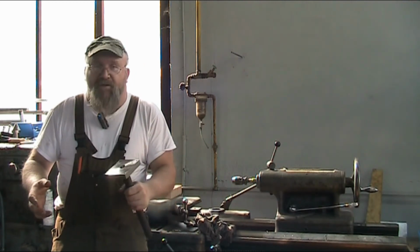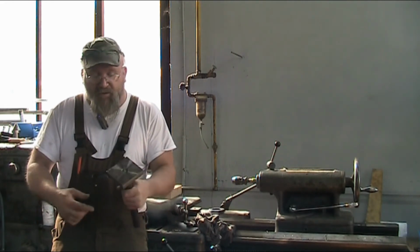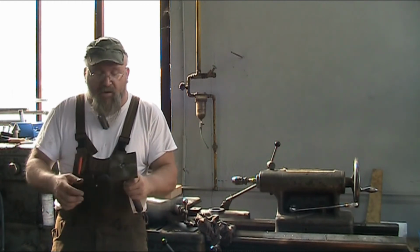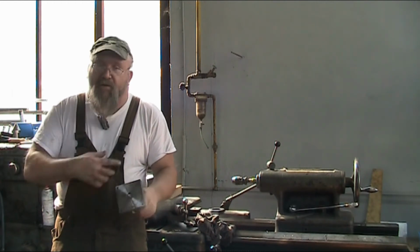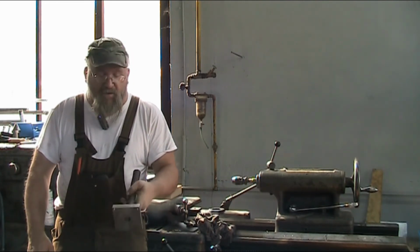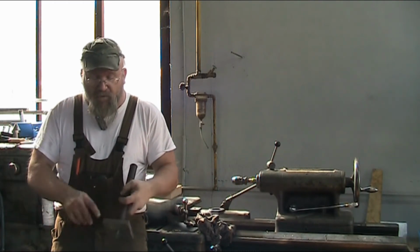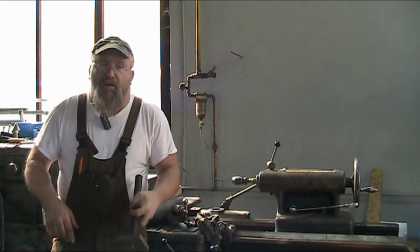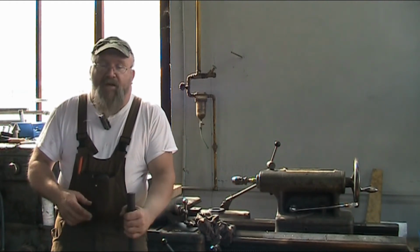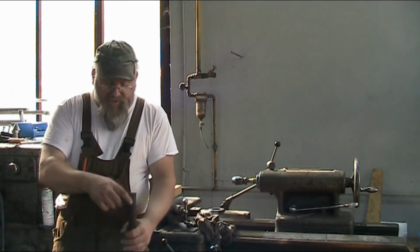The arbor itself was just a straightforward job. Drilled a hole through a piece of plate steel, put a step shoulder in the bore, welded it, chucked it up, planed it off. Bob's your uncle. Of course, I drilled the holes in for the mounting screws before I welded the rod in. Otherwise, you have a hard time getting your quill past this length of rod.